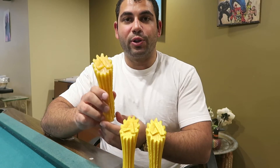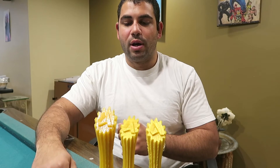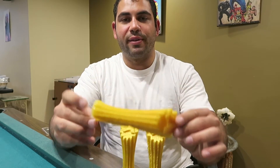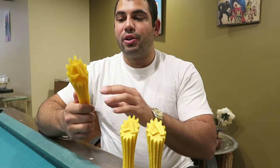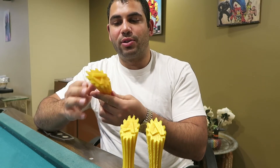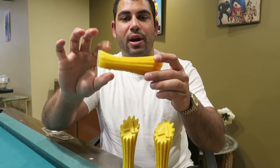This was the very first print. I made it obviously much bigger because the second prints I made afterwards were just to experiment with different 3D print parameters. When I first printed it, I had it oriented on its left side, and you'll notice on the left there are a lot of issues in the details. The main reason this happened was because that side was on the heated printer bed, so over time the heat kept melting into the actual 3D print, making the edges rough and losing the smooth surface the design was supposed to have.